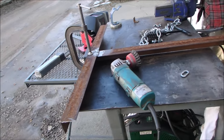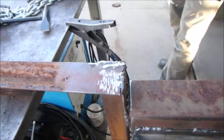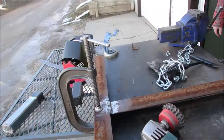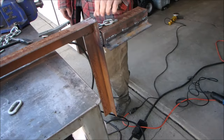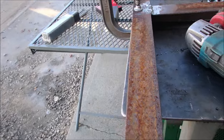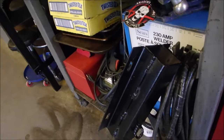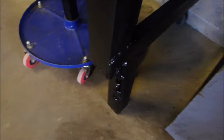So Steven and I have built this thing. It's actually going to mount on a railroad tie here with a sleeve connection. Bolt, bolt. And then this L-bracket is going to go up — this is going to be vertical, and this is going to touch against the door. We'll paint it. I might even wrap that in something so it doesn't get black on the door. I got expandable foam — what we use under tin for ridge caps — and it sticks on and then you press it in and it swells up. I was going to put that across. So that sticks into that from that end. And then the two chains come together for the lock. That was not my design — that was Steve's design. Pretty cool.